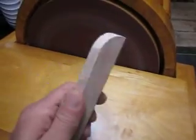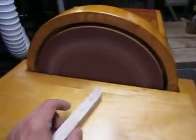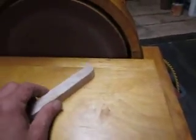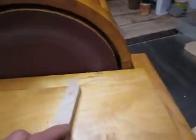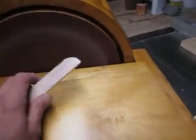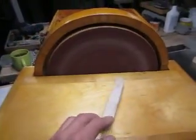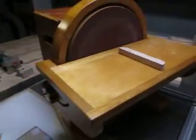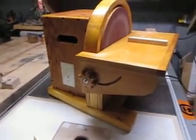That's rock maple, and I have 60-grit on right now. Probably 80-grit would be better but they didn't have any 80, and 80 would be ideal. There's no need to go any higher than that because this is for rough sanding, not final sanding — at least that's what I'll be using this for.